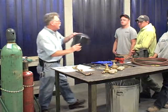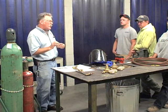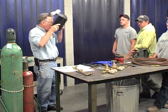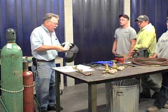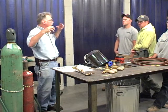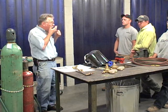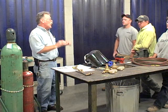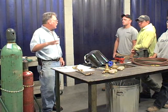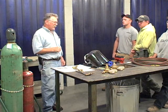And I actually had one of these type of hoods on. Not knowing what I was doing, I just thought by checking it a little bit, it was good. I relit the torch, and having this on, there was acetylene trapped in under my hood here. And as soon as I lit it, whew, the fumes ignited and came around, singed my hair a little bit, and came up around here in my nostrils. So it taught me, when you smell fuel, shut everything down, find your leak, and fix it. That's why I like to go over these simple safety rules of setting up the torch.